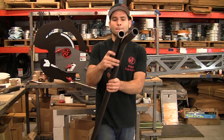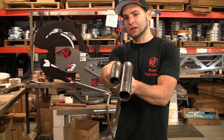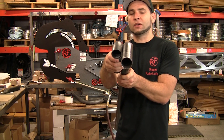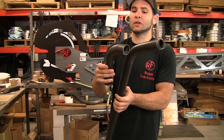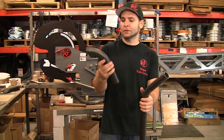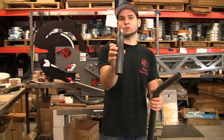So on these, you can see that they are actually noticeably different, even on camera here. This one is the one that we bent earlier — the mandrel was further forward, which does a better job preserving bend quality. But if you have it too far forward, it causes other problems. So that's determined empirically — what the best position is for that mandrel. This one's only 3.3% deformed, which is pretty excellent considering the budget for this machine.